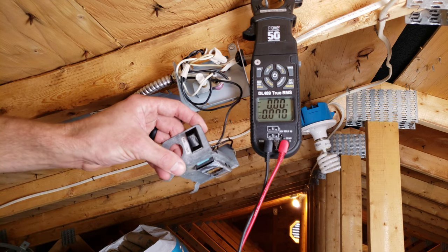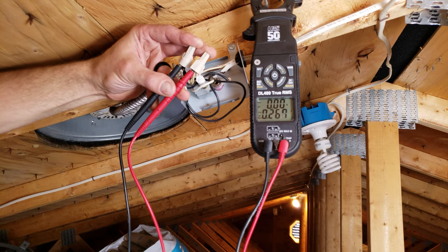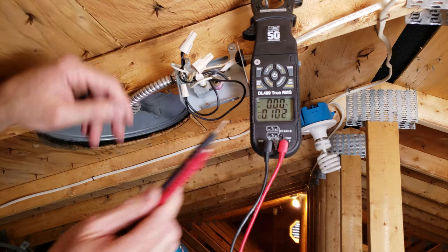Sometimes you have a manual push test that bypasses the temperature switch right here, just to see if your attic fan is going to run. We're moving on to our last test — we're verifying that power is off right now, which it is. It's off at the switch and we verified it with the multimeter.